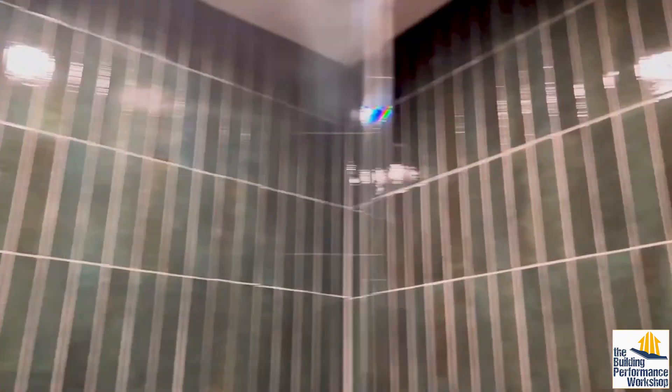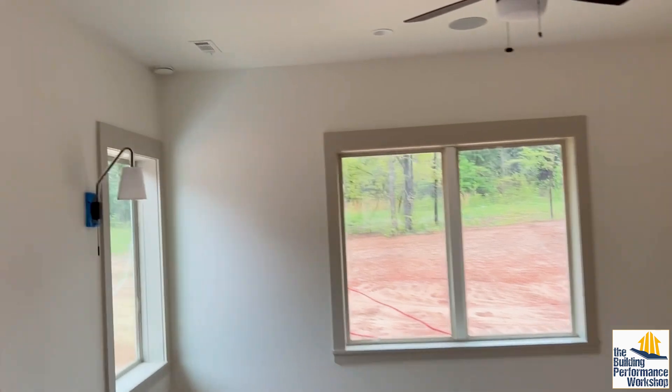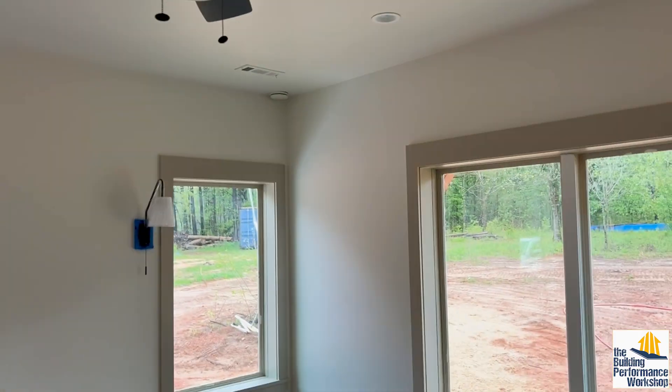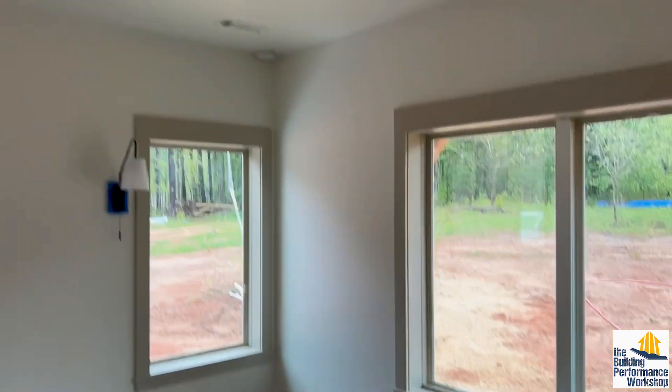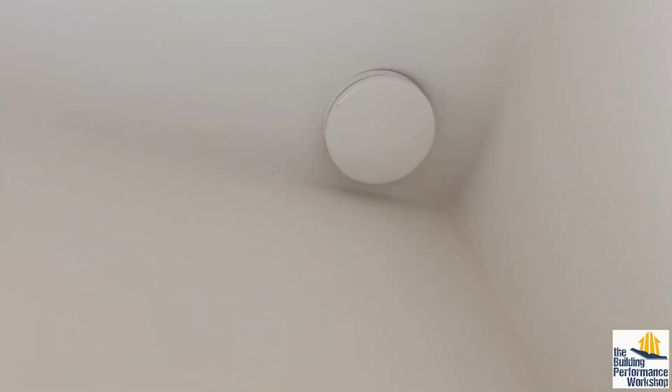But here's one thing that's really cool. In each one of the bathrooms, Chaz has ducted the ERV exhaust inside of the shower, which is always the right place to go. And that's awesome — so there's your shower exhaust. He also independently ducted the ERV supplies, so there is the supply of fresh air that has to sweep all the way across the room to get out and into the hallway. That's generally how you want to do it. He really put it in the absolute furthest corner — I can't even get my pressure pan in between that thing and the wall. So good job, Chaz.